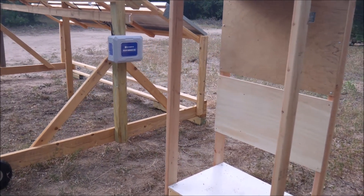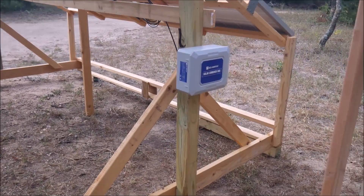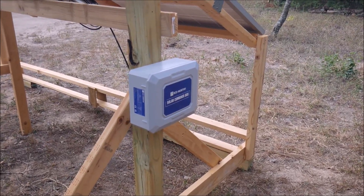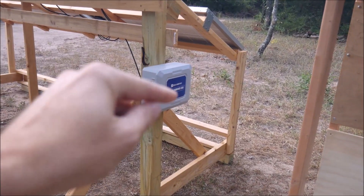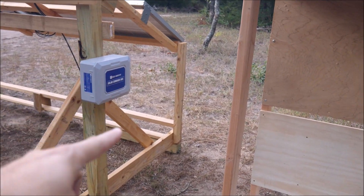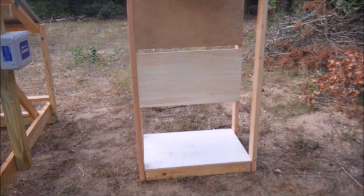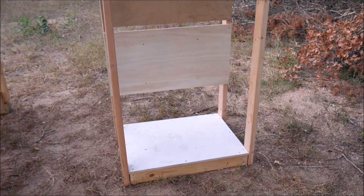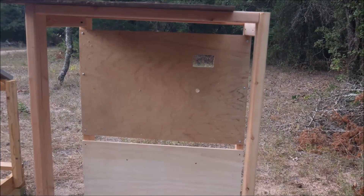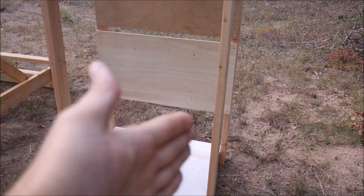I have gotten started on the next phase of this solar ground mount project. I have installed the combiner box on the side of the rack, so all of the strings will combine into that device, and then there will be a single cable that goes into this monstrosity. This is not anything pretty to look at — it is purely made from scrap. Every bit of this I already had in my storage. All I needed to buy was a little more of this wooden siding that can resist the rain and the sun to enclose the sides.